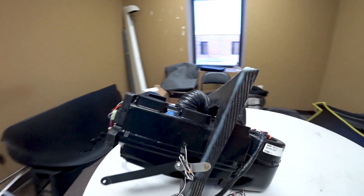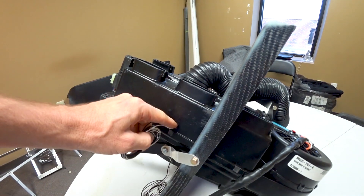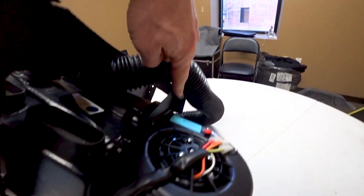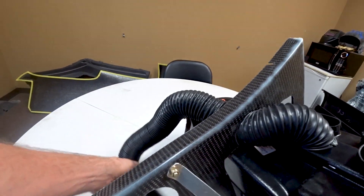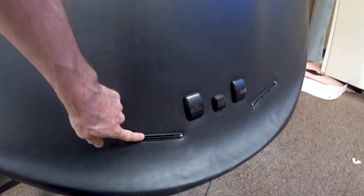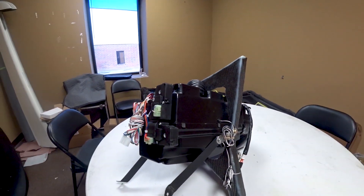On Friday morning I've got the AC unit back out and installed the temperature sensors in various places — those hook up to the climate control add-on that comes with this unit. You can see how I've got all those brackets mounted. I'm also running the SCAT tube; two top ones run to vents on top of the glare shield, the others come out the front and back into the center console for the windshield defrost.